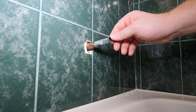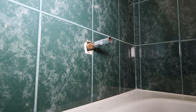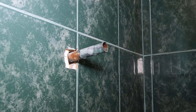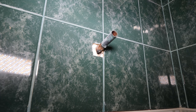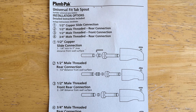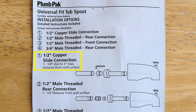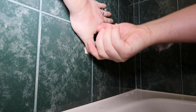One of the most important factors for a slip-on tub spout is that the outside edge of the copper stub out is as smooth as possible without any burrs, so that when you slide on the new tub spout it doesn't damage the o-ring. This stub out is very rough, so I'm going to re-cut it, making sure the length of the stub out from the wall still falls into spec. Checking the specs, a 1¼ inch minimum to 3 inch maximum stub out is acceptable, so I'll be fine cutting off a small piece to remove the original rough cut.